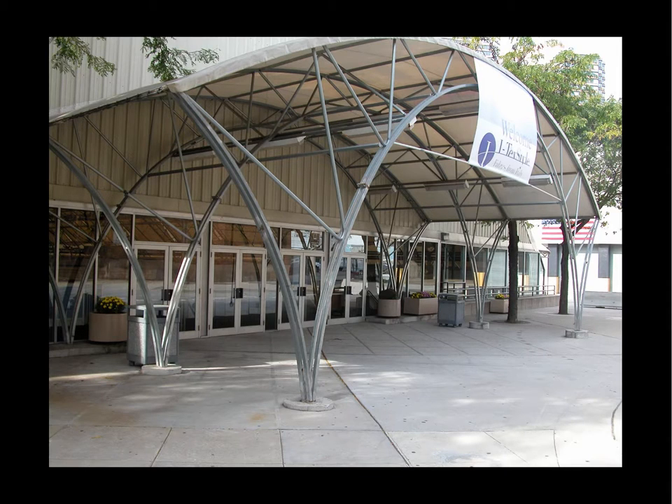Here we see more truss work above arches, stiffening them against roll-through buckling. We have the arch, the web members that stiffen it, and this is actually starting to look like a rigid frame where this element is cantilevering out to there and another one cantilevering over. It is certainly an arch, but also acting a lot like a frame.